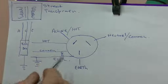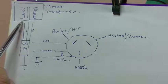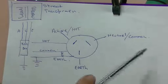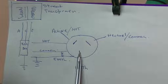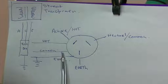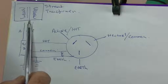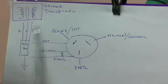An important point to remember is that common and earth are joined together. This happens either at the fuse box or definitely on the transformer in your street. There's a reason for that — it's just an extra safety precaution. Should any equipment develop a dead short or some other flaw and we end up with current flowing into the earth, back along the earth wire, the current has two paths: it can go straight down to earth, which dissipates it, or it can go through your common wire, back through your fuse box, back into the transformer, which is also connected or becomes a centre tap connected to earth.